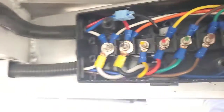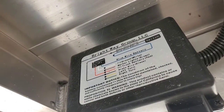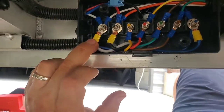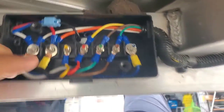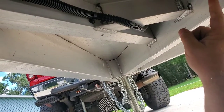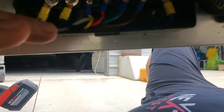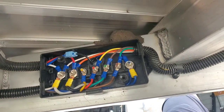It's a little easier to see with those out of the way. We've got the main red wire here on this post and that comes back around along the frame to this battery pack over here for the trailer brake — so in the event of a disconnection from the truck when you're traveling down the road, it sends power to the brakes and slows the trailer down. So this is going to be our ground. All these wires at the bottom of the box actually run inside this frame rail, the part of the A-frame for the tongue — they go inside and then poke out of the trailer up here and that's what plugs into the truck. Really nice and clean. Then there's wires that come out of the top — those go inside for the trailer wiring for the lights and they actually go inside to that inverter panel as well. So we know we need to hook on this power wire and go to the inside of the trailer to the battery.